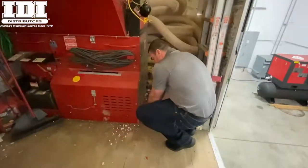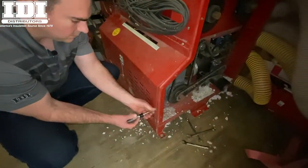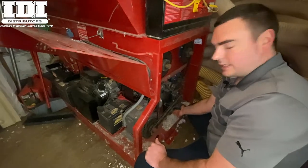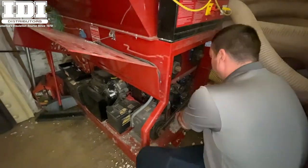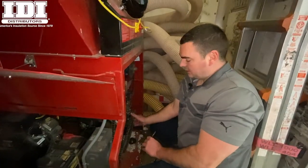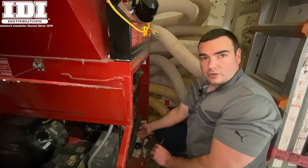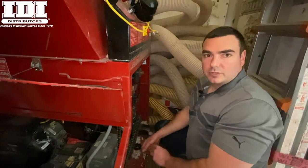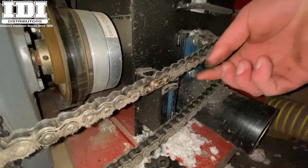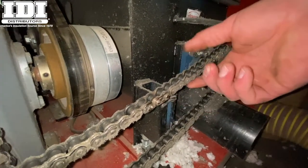Now we're down to our airlock. First thing I'm going to do is loosen up this sprocket, which will allow us to remove this chain. A lot of times you can get the chain loose enough by just taking off the sprocket, but this chain wasn't quite long enough, so we're actually going to pop the master link. Once we pop that, we can disconnect the chain and remove it. This here is the master link — you can see it has a little clip on it, different from all the other links. We put a screwdriver in and pop that link off, and the whole chain comes apart.